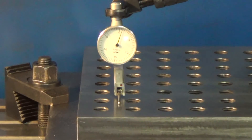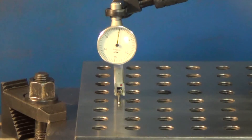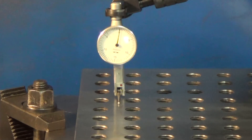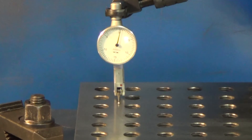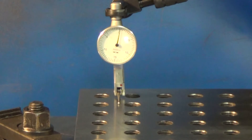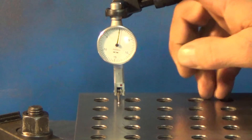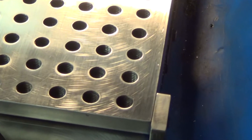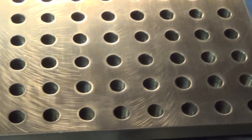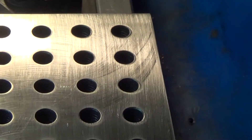So let's go ahead and check this out. We've got a few fly cutter marks, so I didn't expect it to be dead zero, but it's not bad. Just to show you, the gauge is actually touching. We have a few fly cutter marks on the top surface so it doesn't come out dead zero, but we're going to work on a grinding system to fix some of this up a little later on.